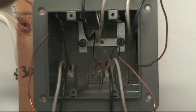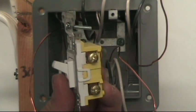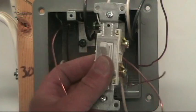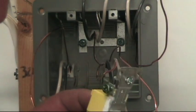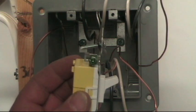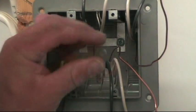I've got a nice tight close-up shot here. The switch I'm going to use is a single pole switch with two brass-colored terminals on one side. As I talked about, the terminals are on the right, and this switch does have a ground terminal. That means you do have to ground that switch — that's the rule of thumb: there's a terminal provided, use it and put a ground on it.